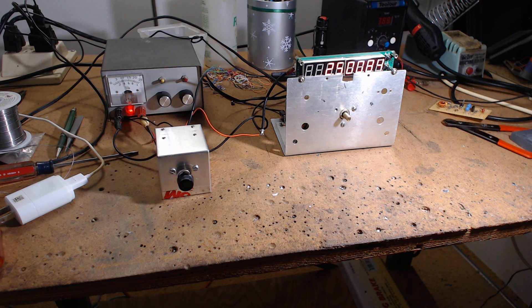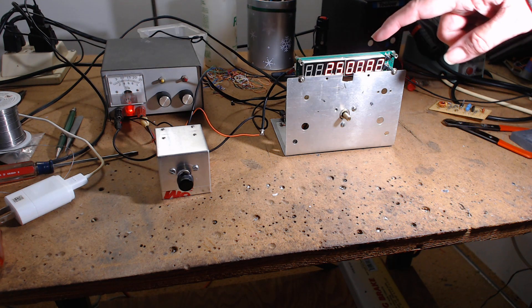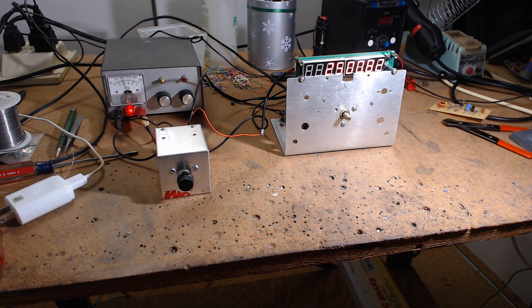The huff and puff does introduce a tiny bit of noise. DDS units produce a different kind of noise — not in the audio, but up and down the band. This frequency counter from eBay also produces frequency birdies on your band; you'll get a carrier and then shut just the frequency counter off and it goes away. There's a lot involved when you build things.